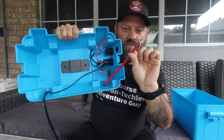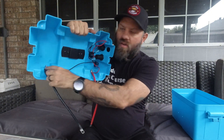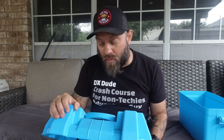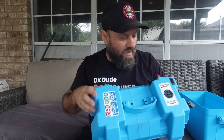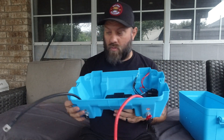It comes with a switch to switch everything on right here, and a power meter right here, and there's nothing at all on this side. Underneath, you've got a positive, pretty good-sized cable — maybe 6 or 8 gauge, probably 8 gauge. Positive and negative. The positive side is wired up with basically what feels like 12 gauge wire. There's no power poles, no shunt, no solar charge controller, and there's a lot of wasted space. I could put two more sockets here, or USB sockets and power pole sockets, or a larger meter. It's a large box with a lot of wasted space in my opinion. So I'm going to hack it up — change out some ports, put some power poles in it, and put a couple other things in it. Today I'm not going to add a solar charge controller, although I probably will later — maybe on the top right there.